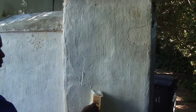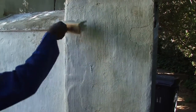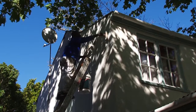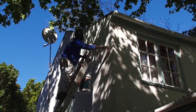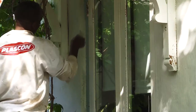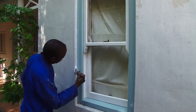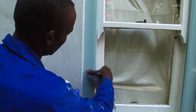Whitewash is transparent when it's applied but as it dries it covers marks surprisingly well. If you find a spot you want to cover again, just coat over that spot — the whitewash coats will blend together perfectly. It usually touch-dries in about an hour and dries completely in about 24 hours depending on weather conditions. It reacts chemically with the wall plaster as it dries and has the advantage of sealing surface cracks in the wall.